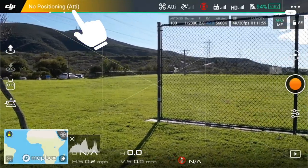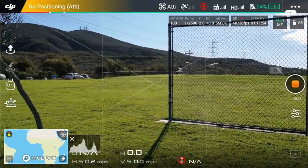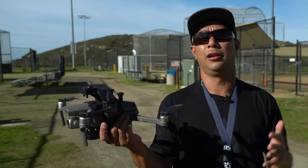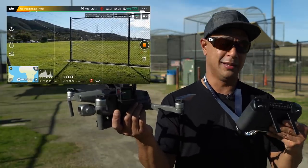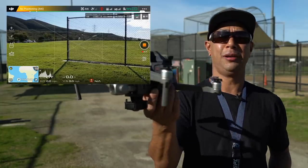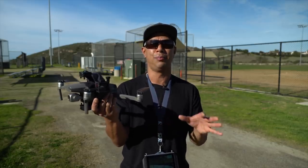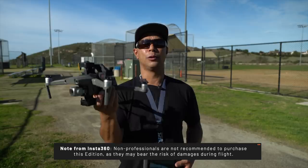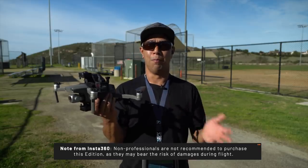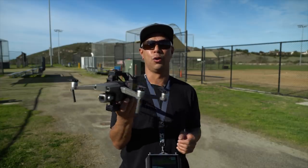Right away I'm looking at the app and it is directly in no-positioning attitude mode. If you're not familiar with attitude mode, it basically means you don't have a GPS lock. So even though we're outside — where ideally you'd want to get a GPS lock — because of this type of rig it is now covering up the GPS signals, so you're not able to fly in GPS mode on the Mavic 2 Pro. What does that mean? Basically, most people buy these drones so that you can stick it up in the air, let go of the sticks, and it'll just hover. But here we're blocking the GPS with this rig, which means it's going to be in attitude mode — all manual. So if there's any wind or environment changes, this drone will actually drift with it, and you as the pilot need to manually fly the drone without GPS.